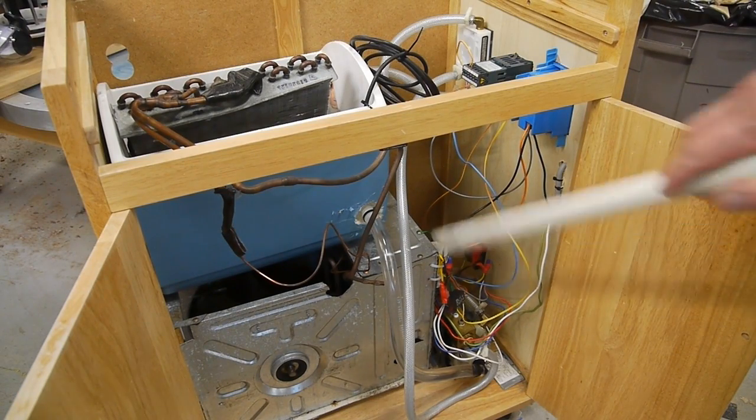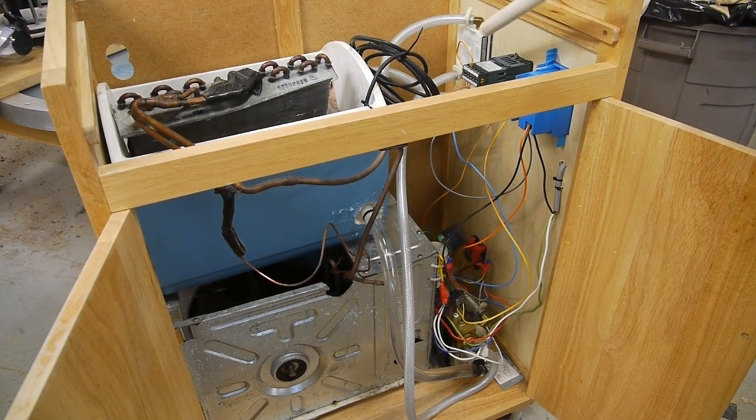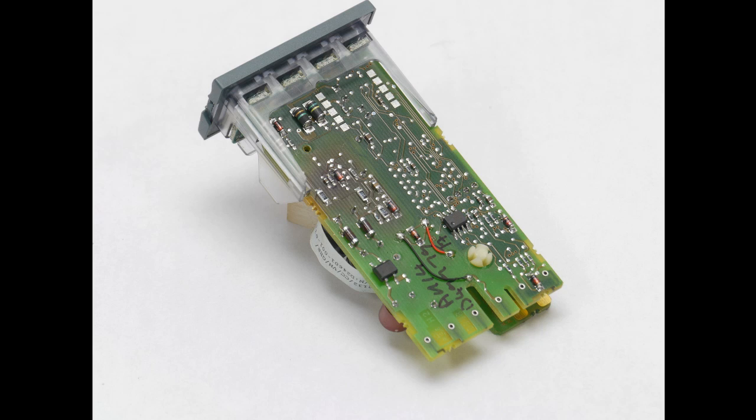For cooling, to control this air conditioner, normally the PID unit has a relay internally and you can use that relay to switch 110-volt power, but the unit is only rated for two amps. I took it apart and as it turns out the relay is actually rated for six, but even still this air conditioner is going to draw more than that.